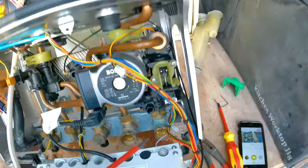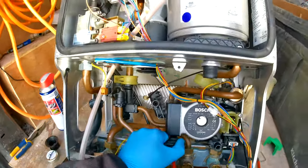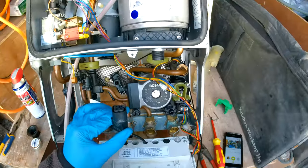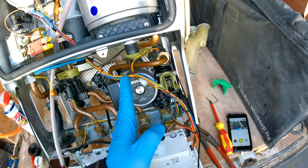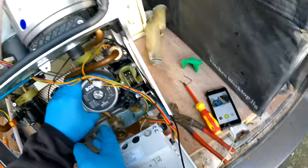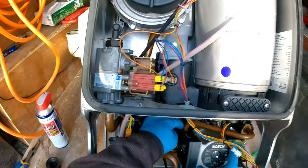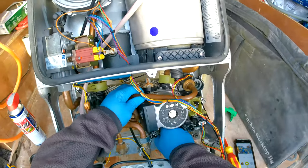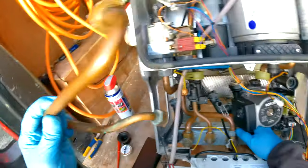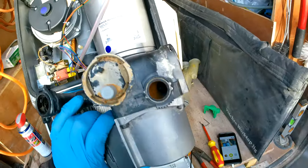We have a cable for the pump — there's a little clip inside that we push up and it should wiggle out. Now that's all done, the pump body should just slide left. First take out the cold water pipe, and then the pump body slides out as well.